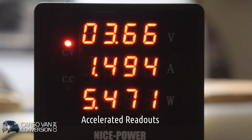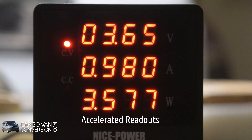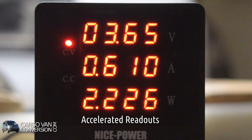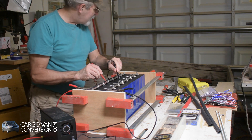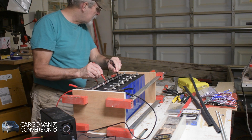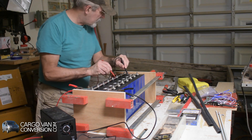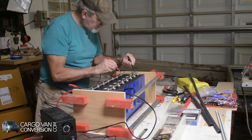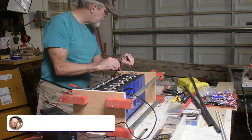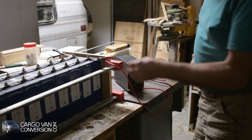It's in its final stages of charging. You can see the voltage stay the same. The amperage and the watts are falling, so I expect that within the next hour or so, maybe half an hour, it'll be on zero. That means the battery cells have been balanced - this one is 3.653, this one 3.653, and 3.653 - so they're all equalized now.